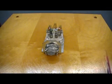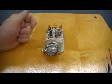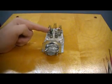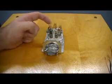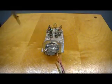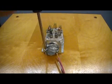You see the color code — you know how this works. You have two brass screws for your two hot wires, a green screw for ground, and a silver screw for neutral.